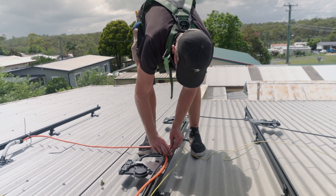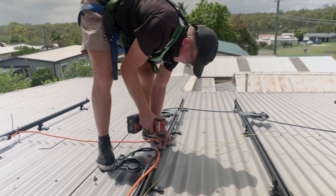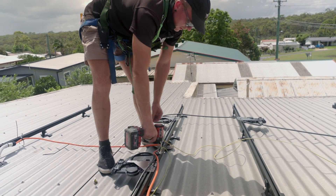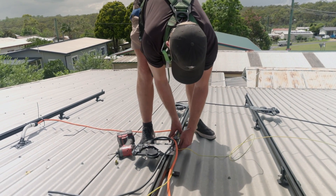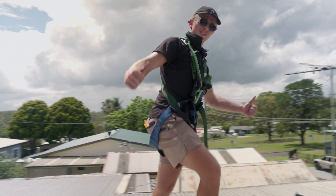Sit our earth lug here on, slide it right the way up and in. Don't like to have too much copper showing — sit it nice and tight. Pull test and we're done. Then tie this up nicely into a little service loop, tied along, and earth out the rest of my rails.